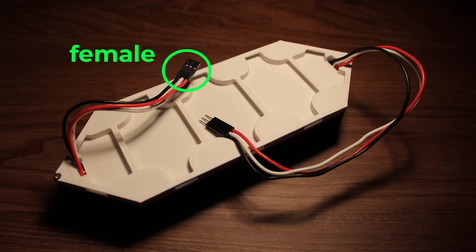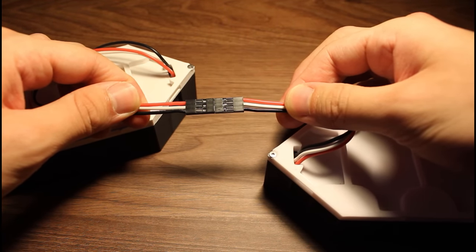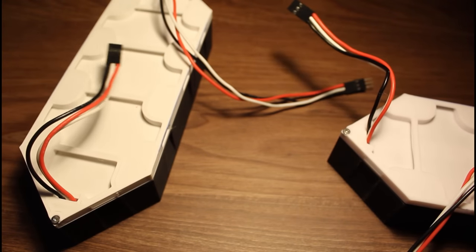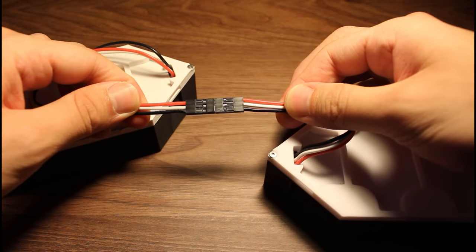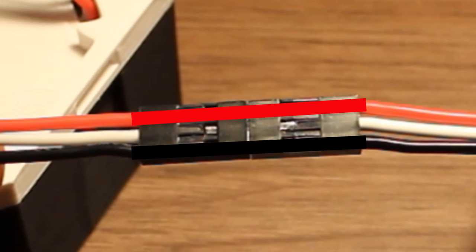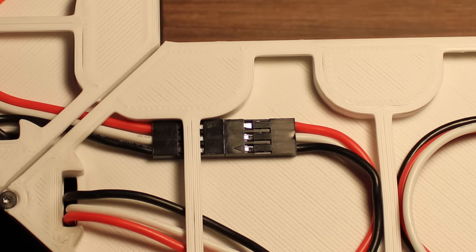That right there is a fully assembled segment. It has two sides: the female side and the male side. This way, you can easily connect segments together by simply connecting the wires. This also prevents connecting them in the wrong direction since female-to-female will not connect. However, we have to be very careful when connecting segments — the red wire needs to go to the red wire and the black wire to the black wire. Always double and triple check the orientation so you don't damage your LEDs.